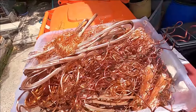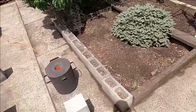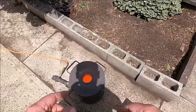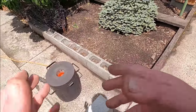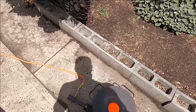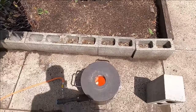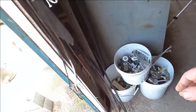All right, I thought I'd just add that in while I'm waiting for the furnace to heat up and the copper to actually melt. We're getting there. I've got two old bars in there that turned out lopsided, didn't turn out very good, so they were always going to be remelted. And underneath is just some bare bright that it's sitting on. So still got probably 10 or 15 minutes to go before that's set up.